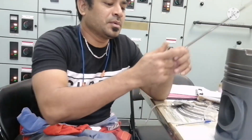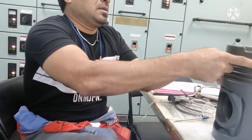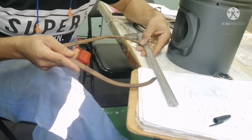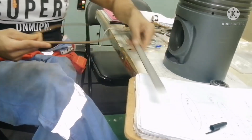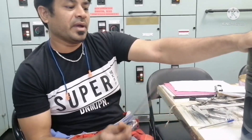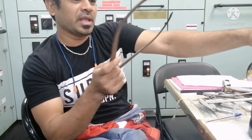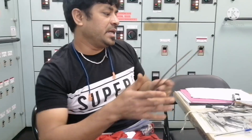Just for information, suppose this is the measurement — you take it like this, compare it with your scale: 10 to 180, plus 4.5 — the diameter comes to 185. It is better to always use an outside micrometer because this outer caliper doesn't give the exact value. I will try to show you in my next video how to take the outside diameter with the help of an outside micrometer.